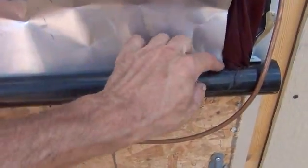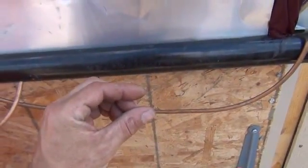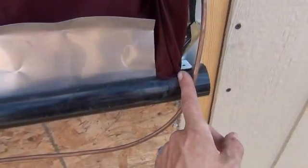What I've done here is used a skill saw to miter in — or to router in — about a 3/8 inch groove all the way across this piece of PVC, other than at the very ends. It stops right here.